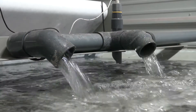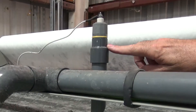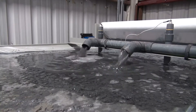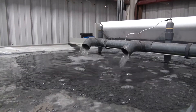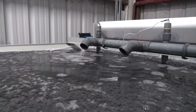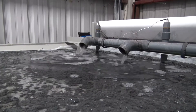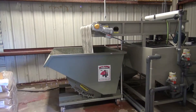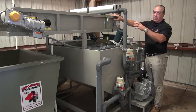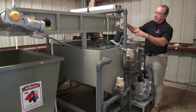While the system is pumping the processed water up to the filter belt, the filter belt is monitored by two probes which when the filter paper becomes blinded, the probes touch the water and the system will then turn the pump off from feeding the water up to the belt and advance the belt forward automatically, indexing new filter paper onto the belt for further processing. This process will happen continuously until the entire process tank is empty, and then it'll send up the final solids that are in the tank and once that is done we have a fresh water rinse on the system that actually rinses out the entire process tank.